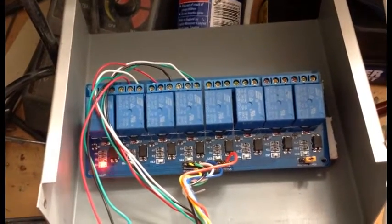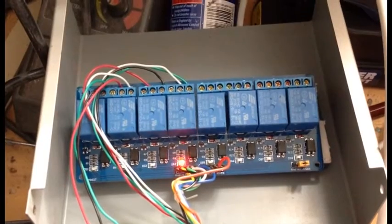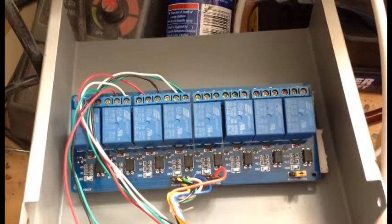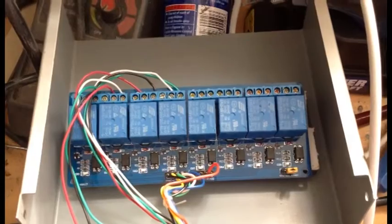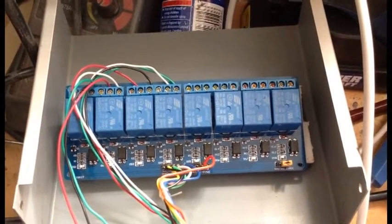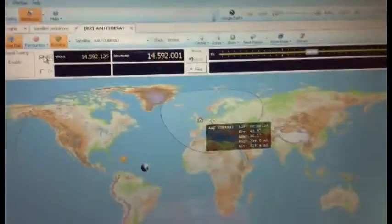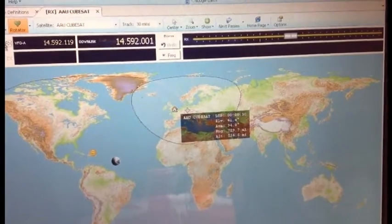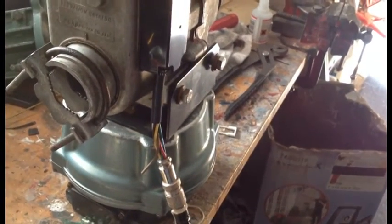The fourth light along is elevation, then azimuth, elevation, azimuth, and then they're both together. As you see, when a satellite gets right over the top of you and the elevation goes too far, generally you'll see that the antenna will swing all the way around and you'll get some really quite violent movements from this. This is where you want to be slowing down.